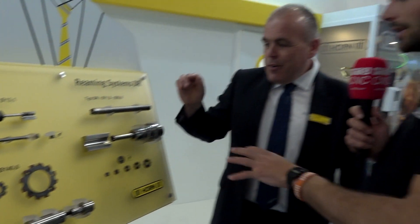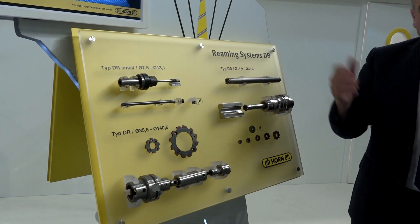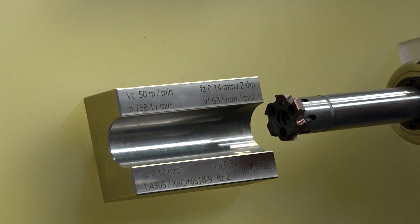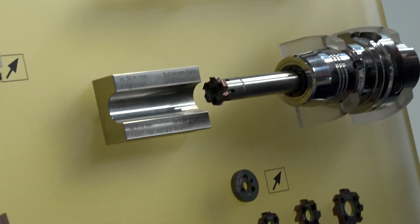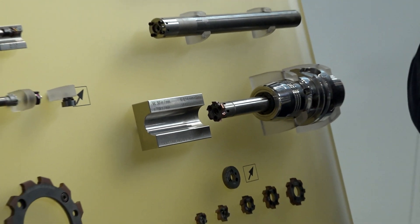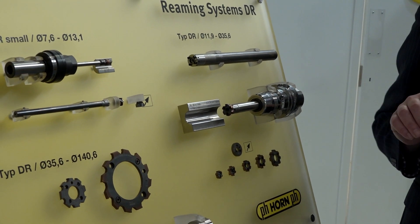All the work you did setting your run-out — because you've got to set the linear run-out and also the angular run-out — on these, because they're only 4.3 millimetres wide, you just set the radial run-out. Clock it on the end. I tell customers to clock it within four microns. I usually go in and do the initial training to make sure everybody knows how it's done, and it is pretty simple. Versus a longer reamer where it matters at the top and the bottom, which is much harder to clock in. We do have specialist reamers where we have to use guide pads going through a valve body, and then we need axial and radial run-out with intermittent slots. But on most of these ranges, just the radial run-out is perfect.